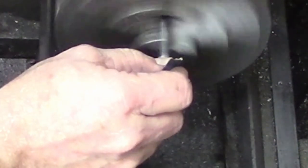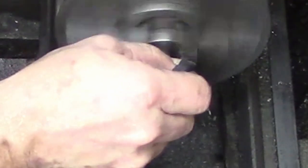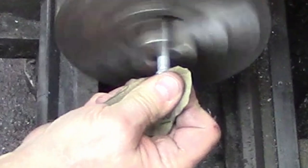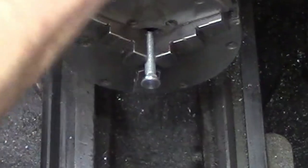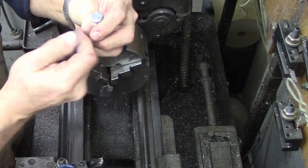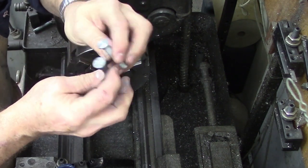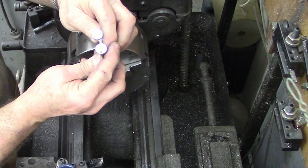As I have time - I've already started on this one - when I sit down at Fusion 360 I'm drawing these out in CAD. These drawings will be available on our Patreon page as I add them. There's nothing there yet, but it's something there if you feel like supporting the channel. When I'm done, I take this over and hit it on the buffer. And this is what we end up with. The bolt looks just like that other than having the unthreaded portion. That's a perfectly functional part that you spent all of 10 minutes on and 50 cents to a dollar. You've got a usable bolt there.